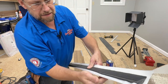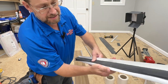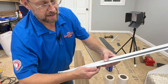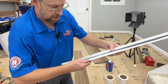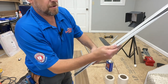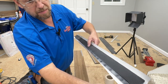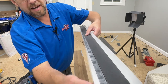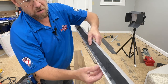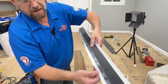You might see it puckering back up there. What is actually puckering is not the tape itself. I'll show you in just a second. It's actually the non-sticky coating that goes on right over this so it don't stick all to itself. It's like the brown paper on the other. It's just the paper that peels off that's sticking. See, watch this. See, the tape is stuck. It's just the paper. You can see where I've mashed it with my thumb. I'm actually going to do a whole lot more mashing. You can see the dark spots. That's where it got mashed on. Watch right here. Now watch that. See that? That's a good adhesion. That's what you want everywhere.